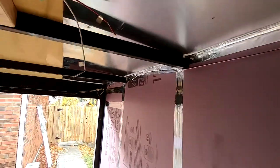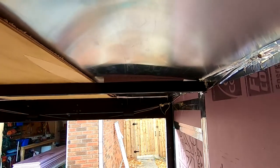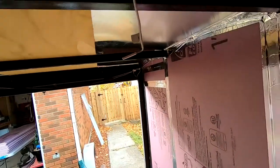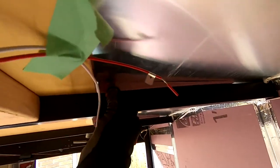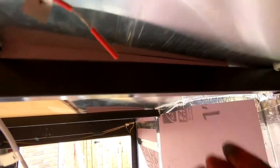The other reason is simply added insulation — I'm adding an inch and a half throughout here. This also gives me a little bit of airspace, and in typical houses you see airspaces all the time contributing to the overall performance of the building envelope. So nothing fancy — with these foam spacers I've made, I'm basically just slotting them in and letting them sit between the roof beam and the aluminum roofing itself.